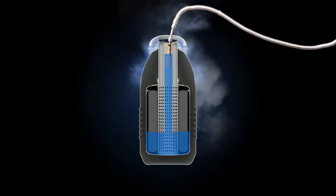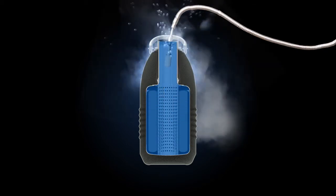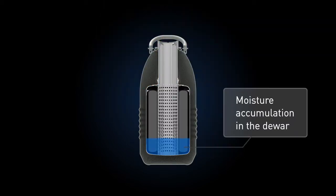When filling your CXCXR product, do not overfill it. Overfilling may result in personal injury and damage to the shipper due to liquid spillage. With regular usage, moisture can accumulate in the shipper as a result of lowering a frosted canister back into the shipping cavity. This moisture will displace nitrogen in the adsorbent material on the subsequent filling and affect the overall holding time.